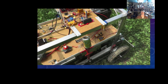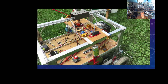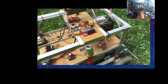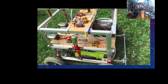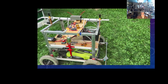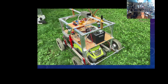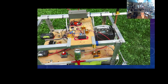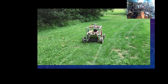A little jerky here — I'm actually trying to hold the camera and do all this too. Manual mode drives around perfectly, just what it did before. The LED is not very bright; it's on but the camera just doesn't pick it up. Now, what activates the rest of the program is flipping it into auto. And when I flip it into auto, it heads out to the first waypoint to start mowing.